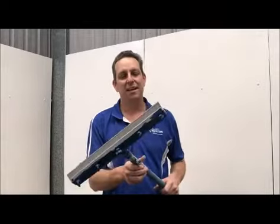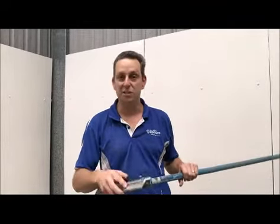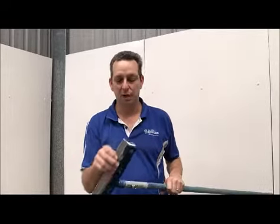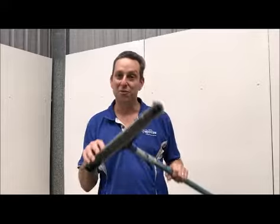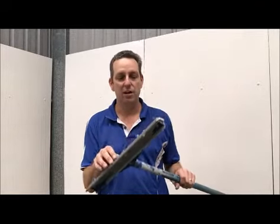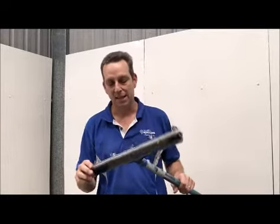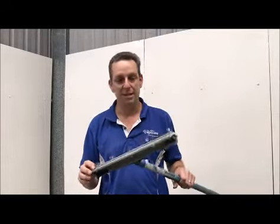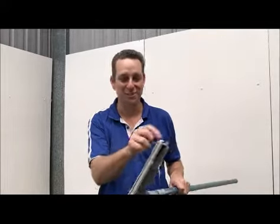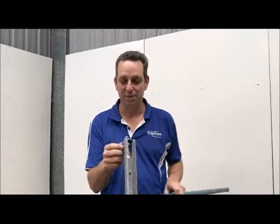So here we're back again, and I've got myself the Midwest Easy Squeegee rake here that I used on this floor, and I just wanted to do the final step. The final selling point, a feature of this rake, was that you can actually crack all the resins back off it, and so that's what I want to test now. I've pulled the tape off. Out of habit, I always tape up the nuts so that there's less chance of things blocking in there.